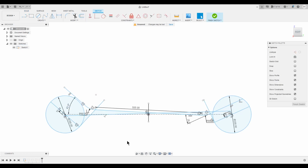So what we end up with in this design and how I've got it planned out is a 42-degree pivot on the front. This is the angle of this slope relative to the ground plane. And in the rear, it's 25 degrees, and I'd be running 0-degree baseplates. So 42-degree turning on the front, 25 in the rear, but the pressed angle on the front would only be 40 degrees, and on the rear it's going to be 28.